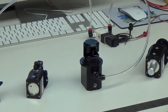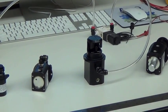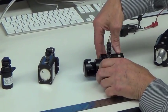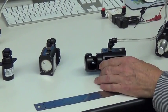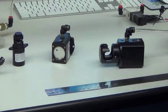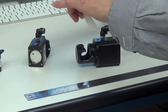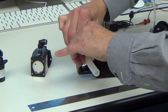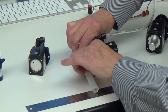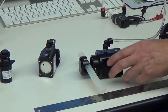I've shown you the valve actuating without tubing. Now I'm going to show a quick overview of tubing installation and actuation once the tubing is installed. We'll open the valve, then taking the tube placed above the tube entry slot, we'll compress the tube slightly and bring it down into the slot, pushing down firmly to seat the tubing — and then it's ready for actuation.